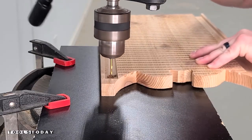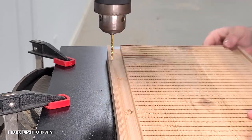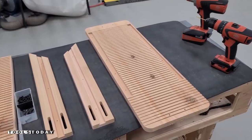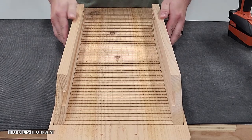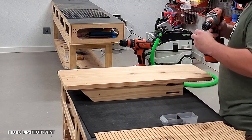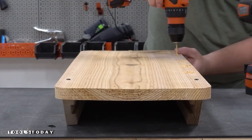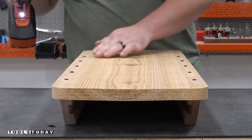Then where we pre-drilled those holes, we'll go through and drill all the way through. We just marked them on the CNC as it's easier to drill through those. We have all of the pieces ready to go so we can begin assembly. We'll insert the side panels into the back panel, flip it over and pre-drill all of the holes, then get everything screwed down using some 1-1/4 inch screws. The way this is designed, everything uses dados to hold it all in place and then the screws just hold it, so I use a few extra to ensure everything stays together nicely.